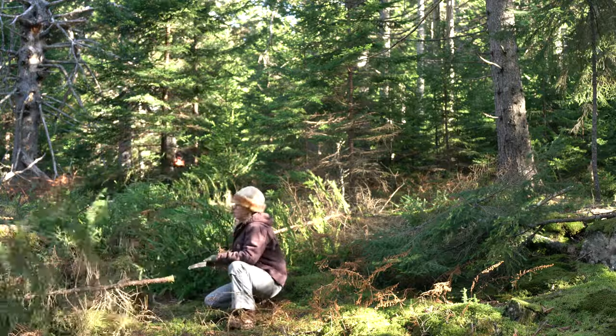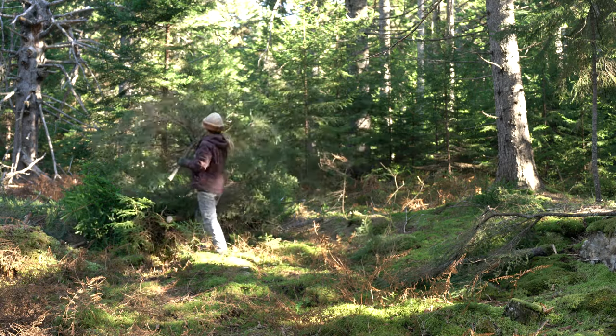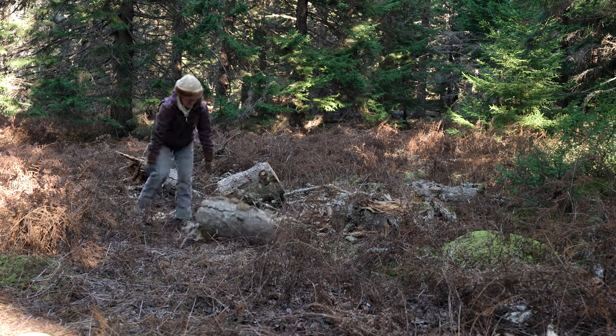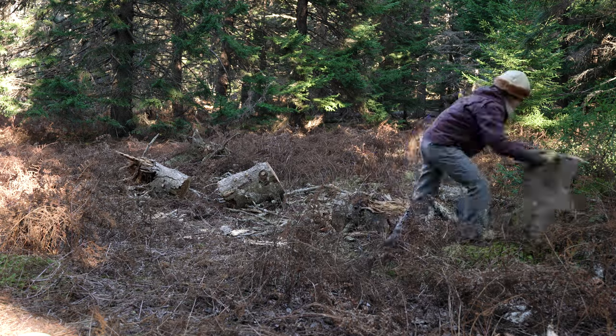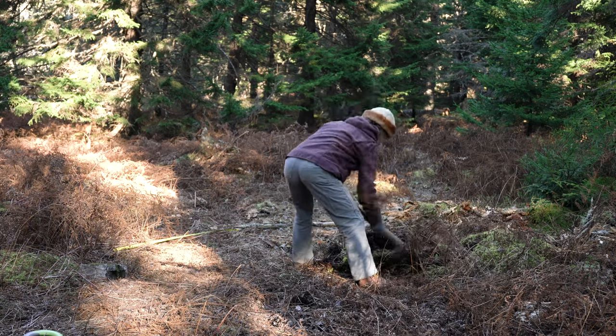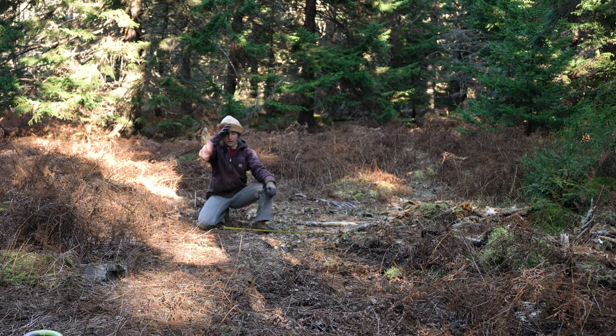Site selection is so important. I wish that I had just spent one rainy day at the spot I picked out for my sauna before building it, because it turns out what I thought was a deer trail is an intermittent drainage. And while it's fine for now, the cinder blocks I have it on raise it up enough above the water level, I might have to move it in the future.